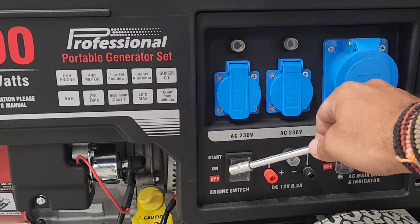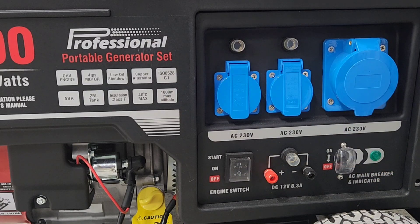First we need to have access to the off/on/start toggle switch. It's a very easy setup. Don't forget this generator also has a manual choke, so we'll be showing the choke linear actuator as well for automation. We'll start by removing the panel so we can have access to the rear.